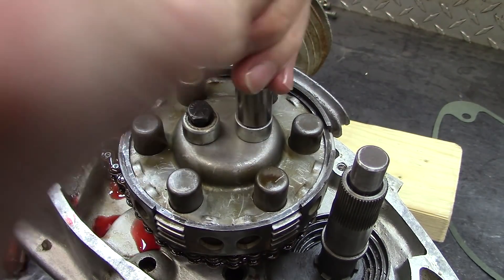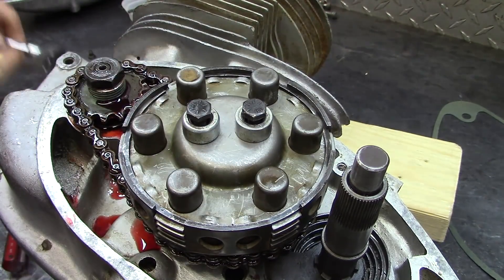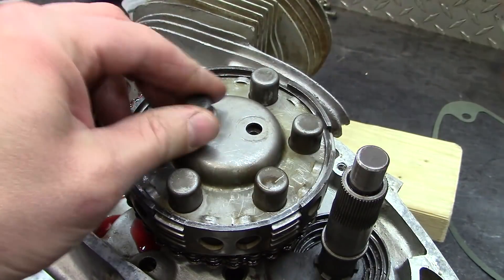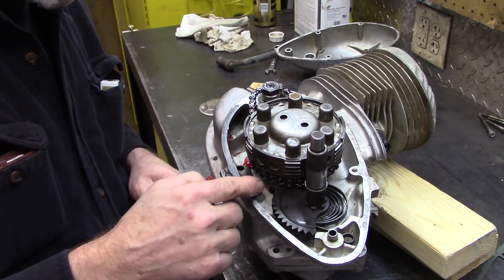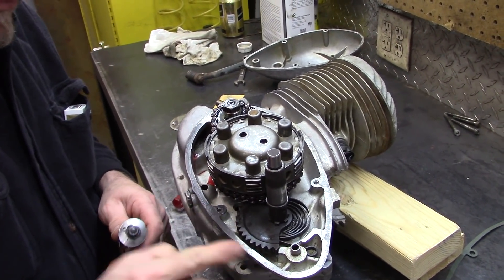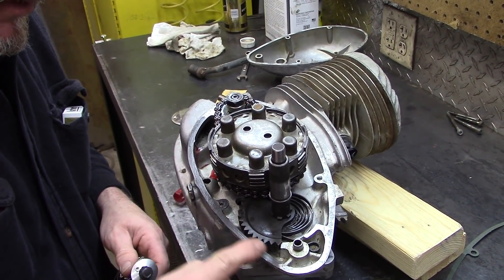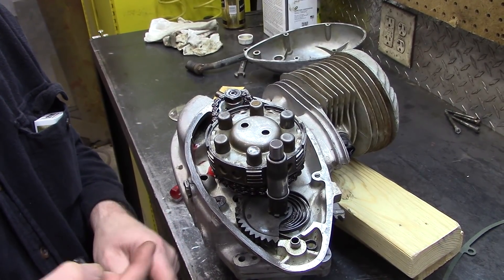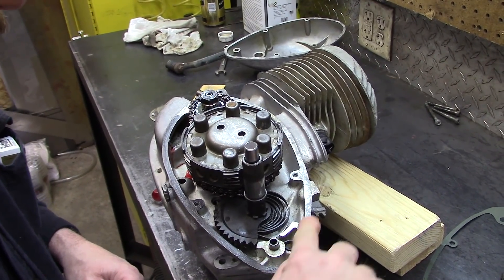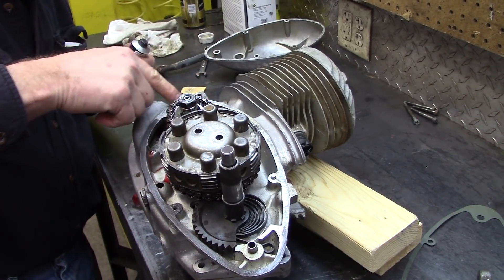She's seating pretty good now. At school we had Permatex that was like a black tar — it just filled in voids. Now this is like a silicone; it's black. I'm just putting a thin smear so it'll hold the gasket in place. I'll put a thin smear on the other side of the gasket just in case. There's a pretty good mating surface here.